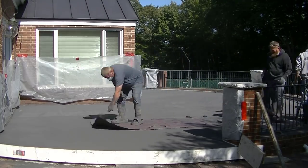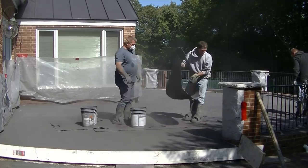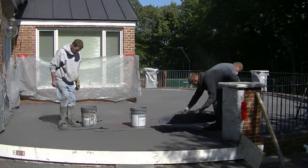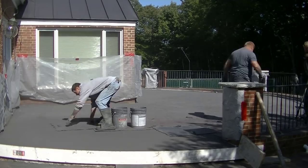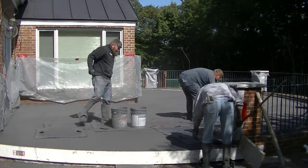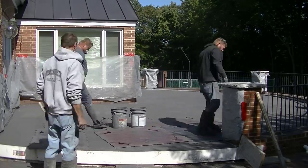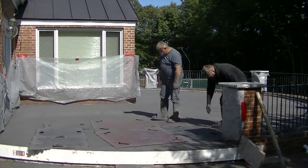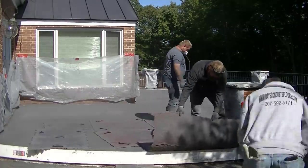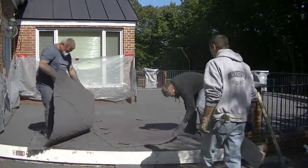Some of you might say you probably should have removed that brick. Like I said earlier, the brick was solid — there was nothing wrong with it other than the homeowner just wanted to change the look. It wasn't settled, it wasn't heaved. When you pour over brick or concrete that's in good shape, it's really not any different than a very hard, well-compacted gravel sub base — what's the difference? So you can pour right over it. He had all the height in the world to bring it up four inches, so it didn't affect any doorways, and he's going to redo all the landscaping on the outside anyway. Pouring over brick or concrete is perfectly fine as long as it's in good shape.